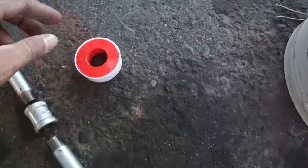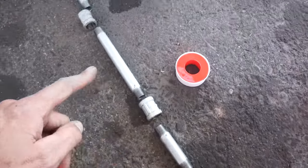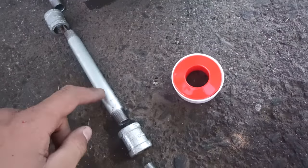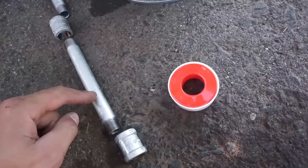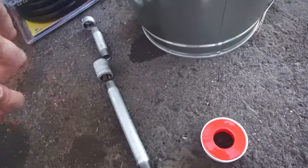You're also going to need some Teflon tape. We're going to wrap all these threads — it'll just make sure nothing leaks. Now I need to drill holes in my pipe first. I'm going to drill a hole every inch and a half with a 1/16th drill bit, and that's where the propane is going to come out as the flame.